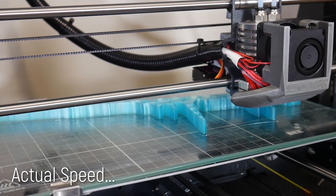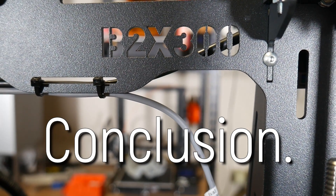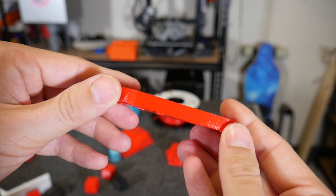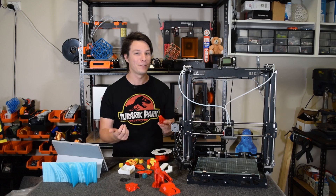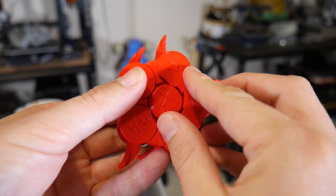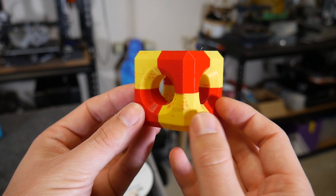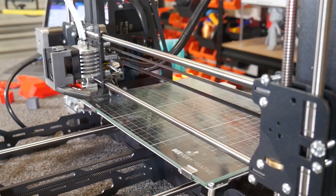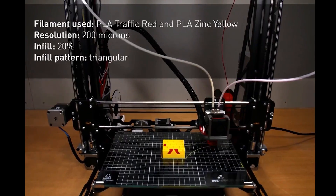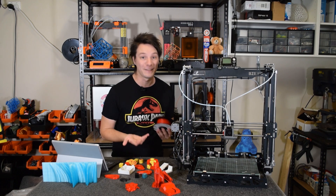Time for the conclusion. What are my final thoughts on the B2X300 from BeVeryCreative? It went from me being concerned about another lemon review to absolutely loving this thing. The print quality and accuracy I'm getting off single colour models is a little bit ridiculous. The default Cura profile is quite slow and the Bowden design is certainly a weird one, but it prints so well that I'll be using this for many of my future mechanism designs. The dual colour implementation feels fairly poor in what is otherwise a very capable, up-to-date machine. The provided spools are hilariously tiny, and the aesthetic won't be for everyone, but I personally quite like it.